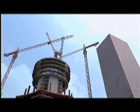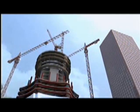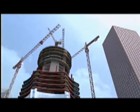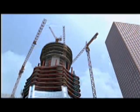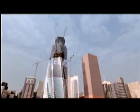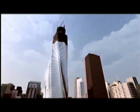There's a sequence of constructing the concrete core, erecting steel surrounding it, pouring the floors, fireproofing the steel, and putting on cladding. It's sort of an extrusion of the building process from the ground all the way to 2,000 feet. Building that to a high level of accuracy is crucially important, so we are using prefabricated elements to an accurately defined geometry. They will be erected in place and the concrete will be cast directly against that steel perimeter form.